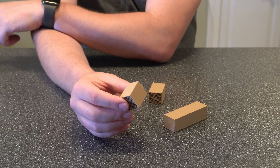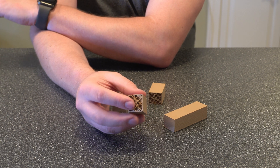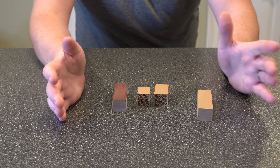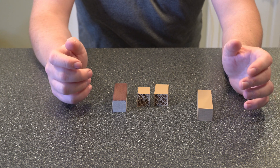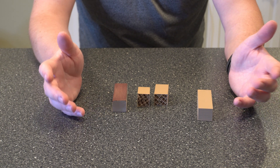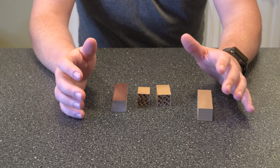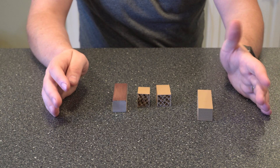On the bowls over here, they're a little bit different — I did a thicker shell just so when you're sanding them, you don't have to worry about potentially going too deep. As for how they print, it pretty much prints just like PLA would print. But it does have a wood burn smell. It's not bad — if you've ever been in an area where somebody's cutting a piece of wood with a table saw or any type of saw, it has that slight burning smell. I'm assuming it's from the wood fibers they're using in the filament. Just be aware that you will have a little wood burning smell when printing with this.